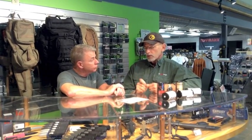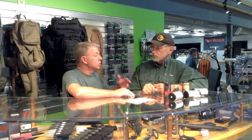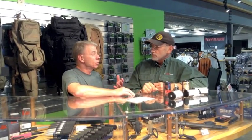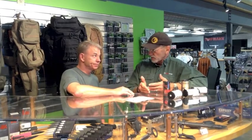So I've got longer fingers — why would I want a Glock trigger? Well, basically, the factory trigger we know is reliable. But most people complain that an out-of-the-box stock trigger is very gritty and has very long pre-travel. What we do is smooth all that out and enhance the trigger so it functions better. We're trying to have you not produce muzzle movement when you break a shot. The least muzzle movement, the better. So basically you've taken what Glock does really well and made it better. That's correct.